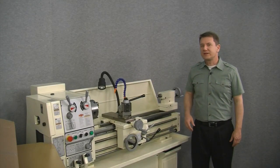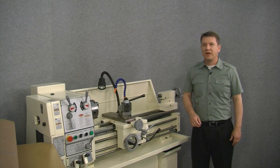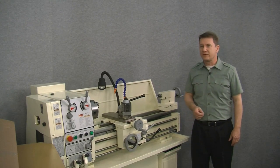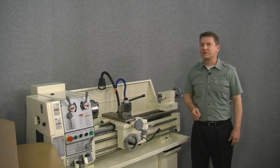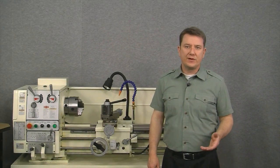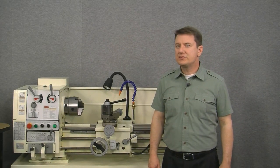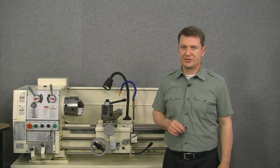And here we can see that it too has a nice smooth machine surface that we could mount to. And with the addition of being further away from dropped parts or chucks, this is why the right side of the cross slide is where most scales end up being mounted. Now we do have a video called Sizing a Lathe, but for those who haven't seen it, let's quickly run through how to find the travels of our machine.